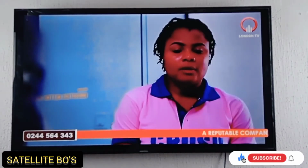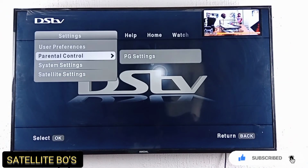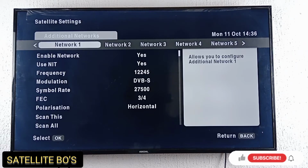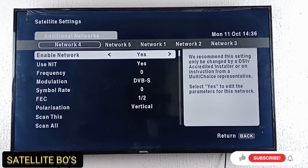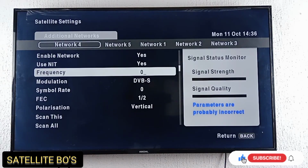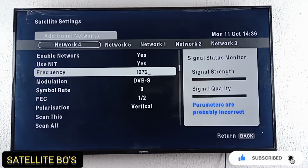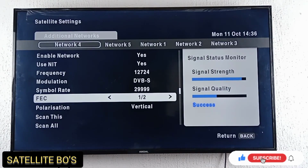So you see, now go back to those settings, then go to that satellite settings, additional network as usual. Now, network one is set, network two is set, network three is set. Now go to network four. We only have five networks. Enable network first, then pick another frequency. The next one, 12724. What symbol rate? 29999. All right, polarization V.